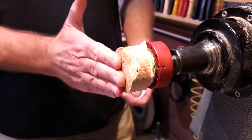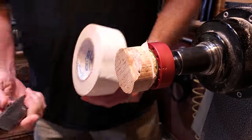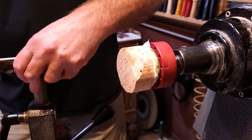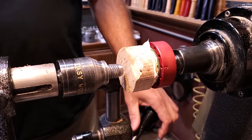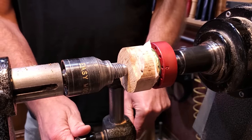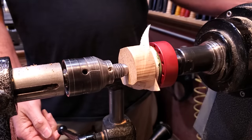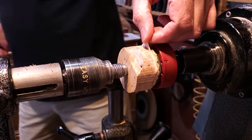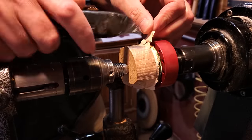What I'm going to do now is bring the tailstock up, true this up — and it's thick too, so I'm going to bring down the width of it just a little bit. Bring the tailstock up, put some pressure on it just like that. You have to make that little popping noise too. I have the lathe speed set at about 2,500 RPMs. I'll cut that off real quick and turn the dust collector on and just true this up.